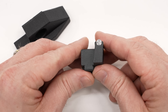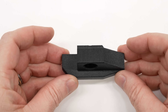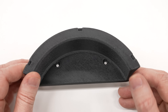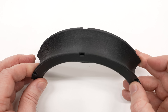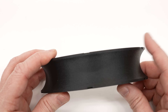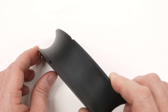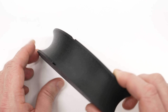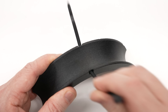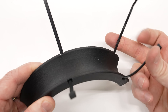Here are some more of the smaller parts for the grinder project and they also look good — I can't complain at all. Here's a larger part I printed to hold coiled up cables on the side of my milling machine. This is also printed in the same ABS GF25 filament and even the large curved surface on the side looks fantastic. This was printed laying on its side so half of that curve is overhang, and I can't tell the difference at all. The openings through it for zip ties to anchor the cables printed cleanly without any support.